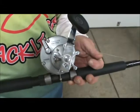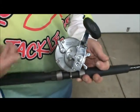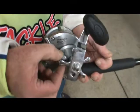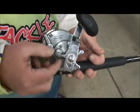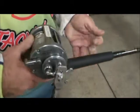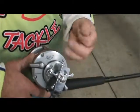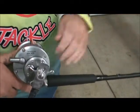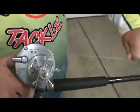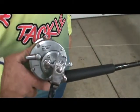One thing I want to show you real quick: every reel manufacturer has magnetics in their reels. People are having problems with copper backlashing and letting it out too fast. What you want to do is have the magnetic just tight enough so that when you're starting out, you have to pull — that way it's not free spooling by itself. Usually once you get out about 20 to 30 feet and the copper starts coming out, it'll start pulling on its own and then you can let it go.